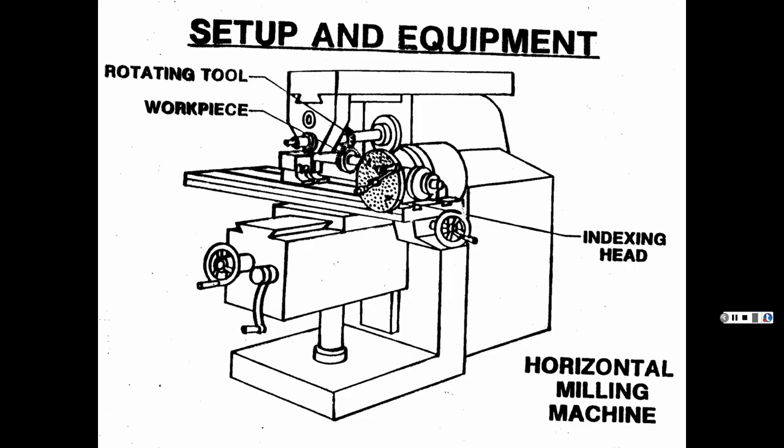All right, anyhow. Now, for a milling machine, because you just have the one cutter there, you cut a tooth, and you have to figure out how many teeth it needs ahead of time, which we'll get into with the charts. You figure out what's the diameter, what size is the gear, what's the ratio, and the charts will tell you, well, you're going to need, let's say, 64 teeth. Then you move this indexing head, where you pull this thing out, and you can put it in one of these holes. Depending on where you have it set in these holes, after you rotate it one revolution, it will move one space where it'll do the next gear tooth, and then the next gear tooth, depending on how many you figured out for the 64. Then you put it in one of these special holes.